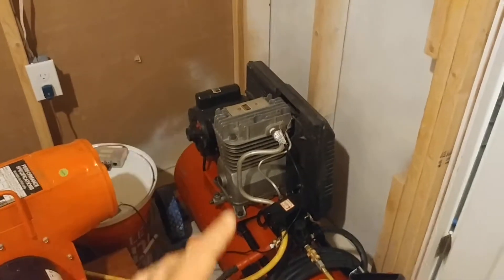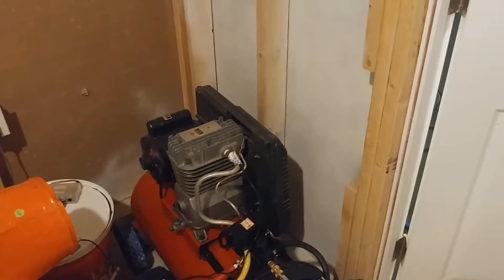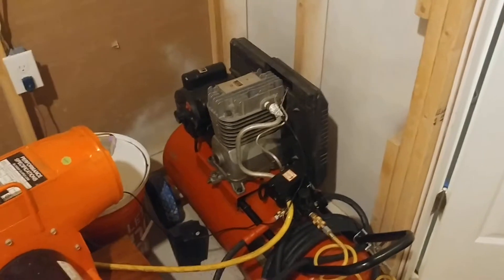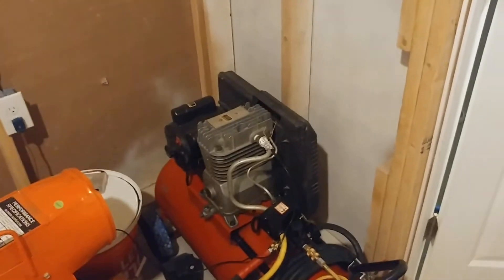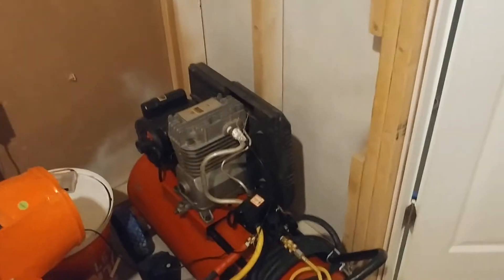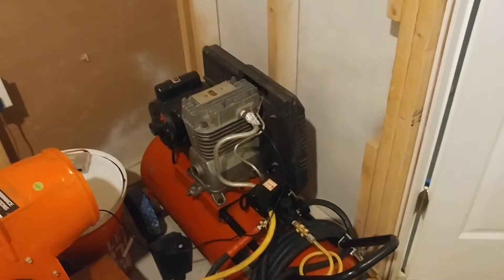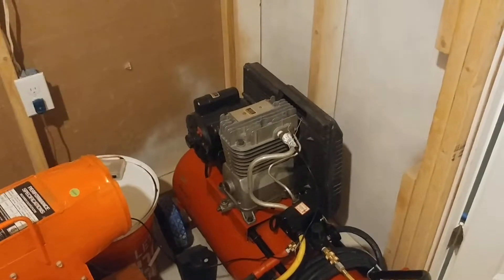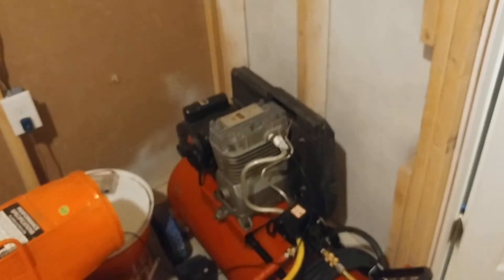I'm currently working on a CNC plasma cutter build, and that means I have a requirement for a large amount of compressed air — about 9 SCFM at 90 PSI. It's really a lot, and this compressor is kind of undersized. It's not a little 120-volt pancake compressor, but it's also not one of the big honking 120-gallon, 10-horsepower compressors. It's mid-size: 220 volts with a 15-amp motor, rated at 9.3 SCFM at 90 PSI — just barely enough to keep up with the plasma cutter. So far I've run G-code programs up to about 10 minutes in length and this thing has managed to keep up, but it runs the entire time and it gets really hot. I don't know what the duty cycle rating is, but I can guarantee it's not 100%.